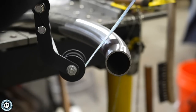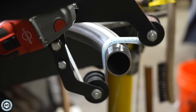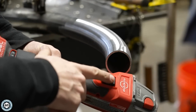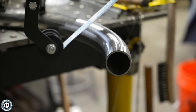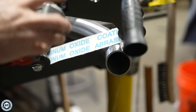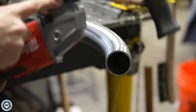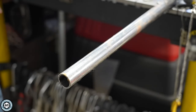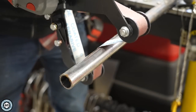You can see this thing can really flex around a piece of material. I like to use grinders with a locking switch because I want one hand on the grinder body and one hand on the handle — just like that it'll really grab around. I can already see mine is getting a little loose, so I just got to go tighten it up again. Here's a smaller piece of steel and you can see it'll also curve around a smaller piece.